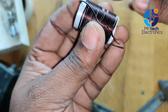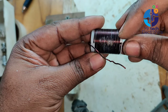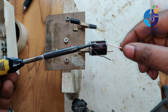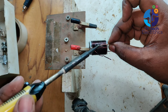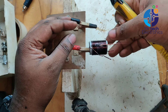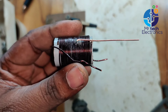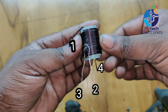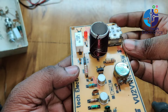After removing the insulation, solder two small wires to the 13th turn and 16th turn of the coil. Now the making procedure of the tuning coil is completed. These are the number of the coil legs. Place the coil on the PCB according to the number printed on the top side of the coil component footprint.